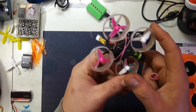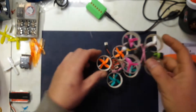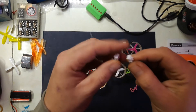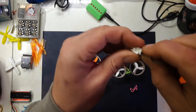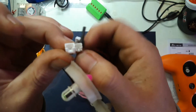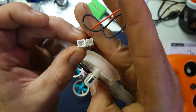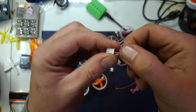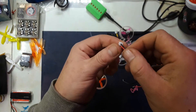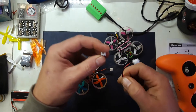One thing I've done is put on my own connectors — these are solid pin. These also wear out with time, and one thing I'm thinking about doing is upgrading some batteries to PH 2.5. Did you know they existed? They're not that much bigger, and they actually have quite a lot more surface area on the pins. This wire is just way too thin for a power cable, so I'm going to have to take these pins out, put in my own wires, and solder those on to the battery.